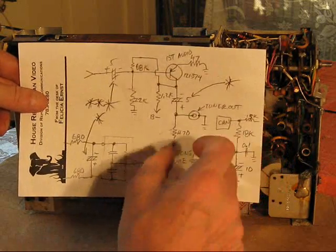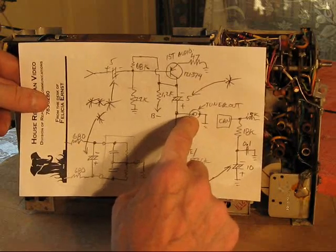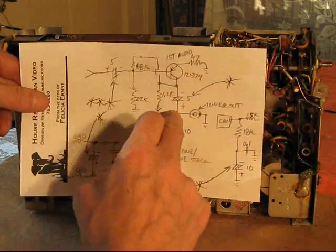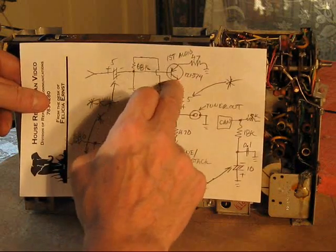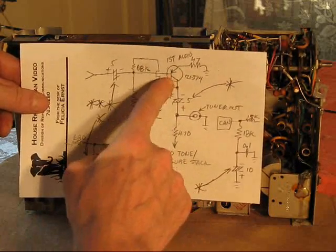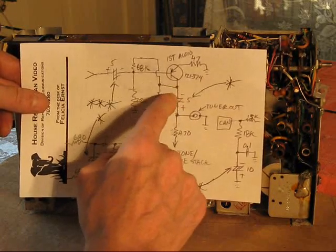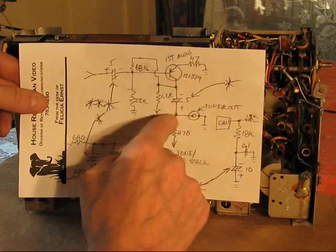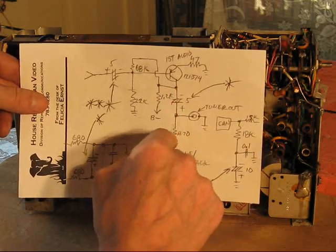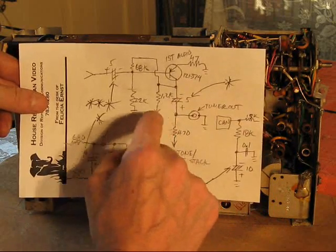There'd be noise. There is an RCA jack on this chassis through which you would extract the signals coming from the tuner after it goes through the first audio stage. Think of that as a preamp, an audio frequency preamp, fed through this coupling cap, a DC blocking coupling cap. That wants AC to go through and block DC. If that thing's open, nothing's getting through. I think there is. It's hard to tell, but that's got to go.